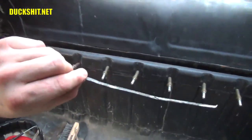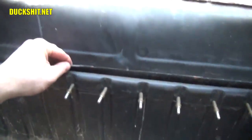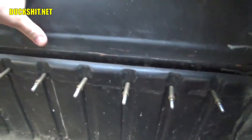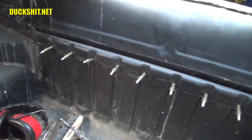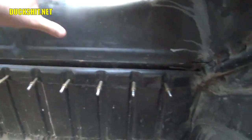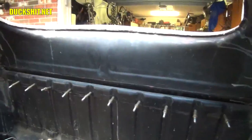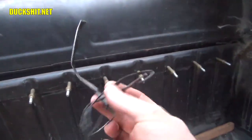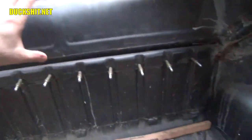As I was cutting, I pulled that piece out of there — it's actually from the top layer. It was a little wide on one side, but right in the middle it was nearly a perfect matchup. I made two pieces; the second piece I had to dig out and pull out of there. Then I can finish up the weld. I'm going to have to do a little sanding to get this Rust-Oleum paint off — I'm really glad I used that to stop the car from rusting in the two years it's been sitting around. But I've got to continue cleaning that up so I have a surface to weld to. If I don't clean it, I'm going to get a really sloppy weld and a ton of burn-through — just not good. Let's finish fishing that piece out of there, burn off some of the paint, and get this thing welded together.